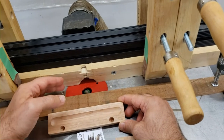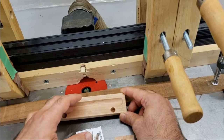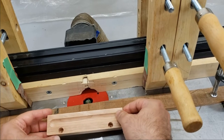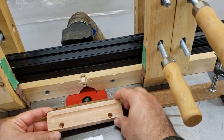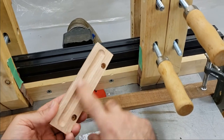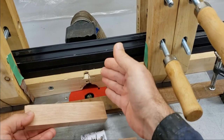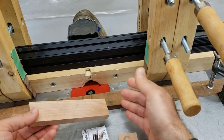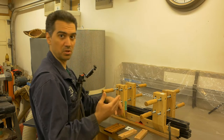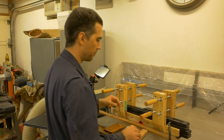And that is because I'm going to be using a slightly older router bit to do majority of the wood removal. And then I'm going to use a fresh bit, remove the fake stops, and then have one clean final pass. I am going to have about 75 pen cases or 150 of those sides to do. So that's going to be a lot of work, and that's why I decided to opt for an older bit and then have one final pass with a fresh bit. Now that we know about the setup, let's go and see what the technique looks like.